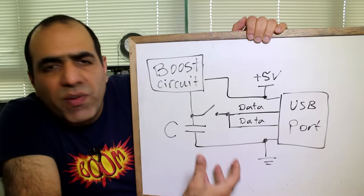Don't use them. Just learn the circuits. There are some interesting solutions to create high voltage sources. But let's not kid ourselves — beside abuse, there is no reason to use a USB Killer on a computer. They keep pushing it as a tester, but no — a product designer has to design per standards for real-life situations, like if the USB cable gets pinched, it must be able to withstand short circuit within the power and data lines, reverse polarity protection, or real-life human body electrostatic discharge. Selling this junk as a tester is like selling a bomb to test your house against earthquakes. No manufacturer has to pass such stupid criteria. Do they actually use bombs to simulate earthquakes? Even if they do, they won't send it to regular people.